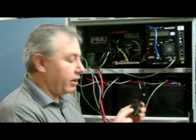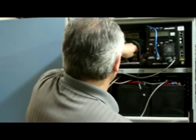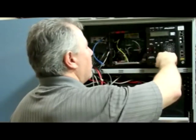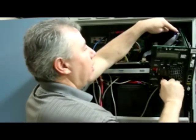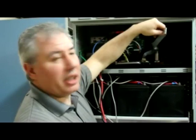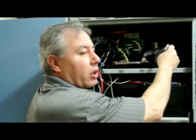The unit is to be looked at with a flashlight. Connections are to be verified. If the relay looks damaged or burned, it is to be replaced. Reinsert the relay in the unit. Unplug the temperature sensor cord and pull the inverter from the unit. Disconnect the ribbon cable using two latches — the unit completely comes out. The ribbon cable is to be inspected for any damage; go the length of the ribbon cable and verify there are no major kinks or cuts.